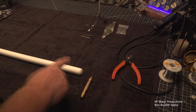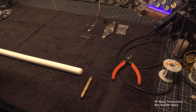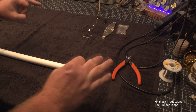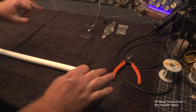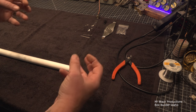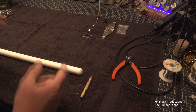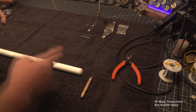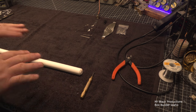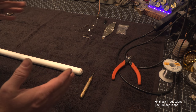The surface area, this is how high voltage insulators work on power lines, by the way, is that surface area on the insulator. Inside they've got a really nice, super beefy fiberglass rod of some kind. And on the outside, they have a boot that is attached to the outside of the insulator. That surface area of the insulator, that's why it's got fins on it. I'm talking about 14 kV and down. They'll use a silicone boot on the outside of the insulator.